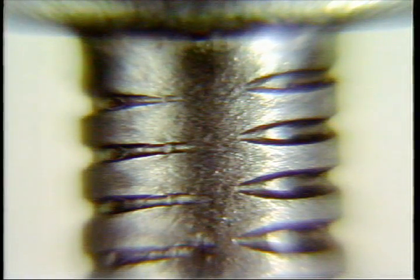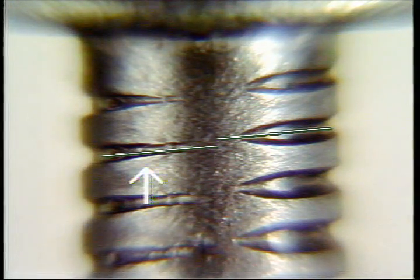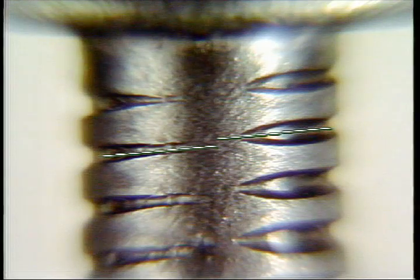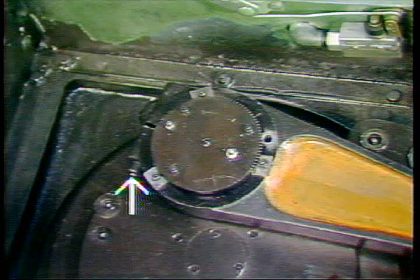You will see two sets of grooves on the blank. The two sets of grooves will be aligned if the dies are matched. Dies which are not matched will produce grooves which are not aligned. The grooves made by the moving die will be to the left of the mark you made on the head of the blank. On this blank, the grooves on the left are slightly lower; therefore, the moving die thread forms are too low and must be raised.